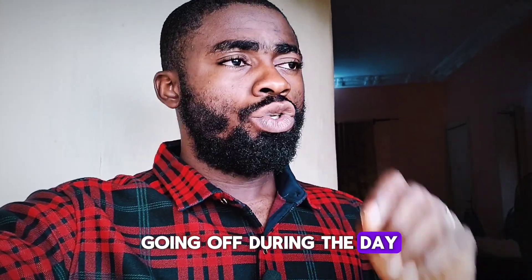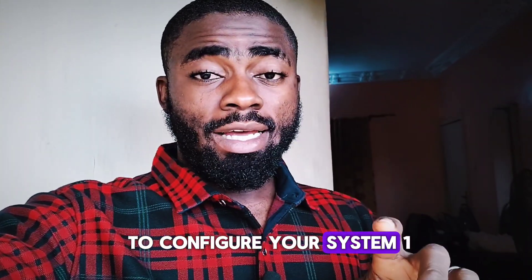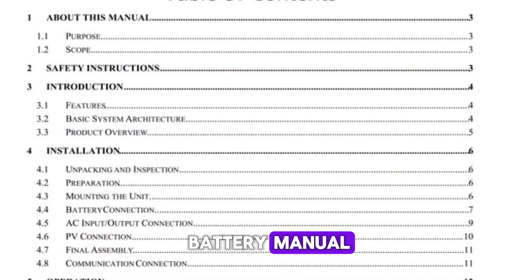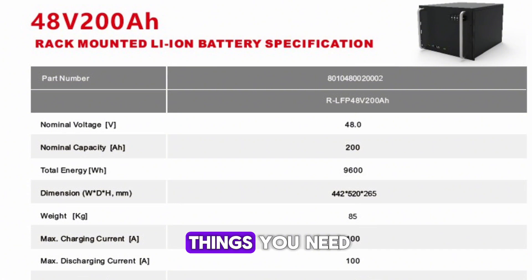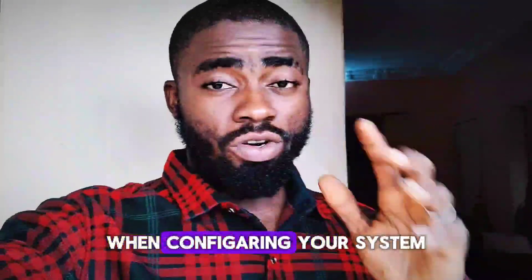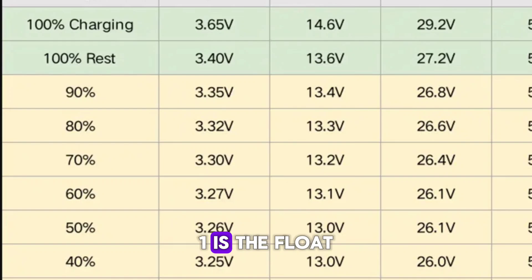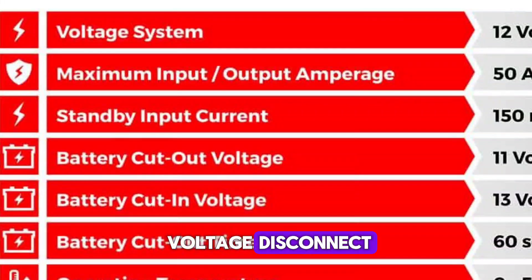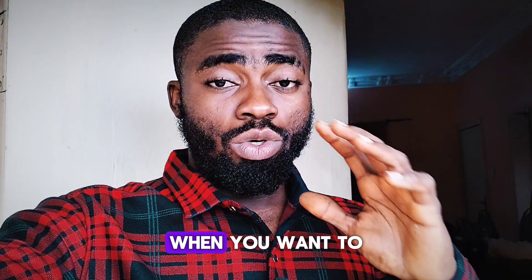So the best way to configure your system: first, you need the manual — either the inverter manual or the battery manual — and you need to check the battery specifications. The two key things to take note of when configuring your system are: one, the float or absorb voltage, and two, the low-voltage disconnect.